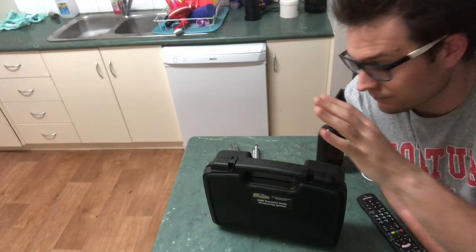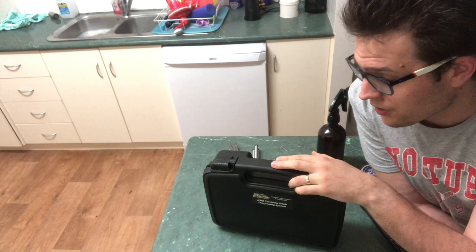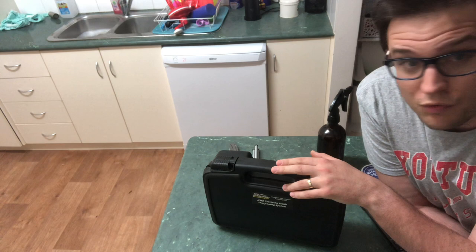So I'm just going to answer the question of resharpenability now by putting the paper slicing super edge back on it, probably just to 600 grit. I think that's what a steel with this kind of carbide form is probably best with. So we're going to use the KME, just use the Sharpie method, and put the 17 degree edge right back on there. So see how we go.